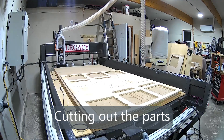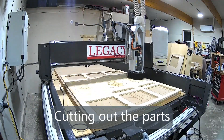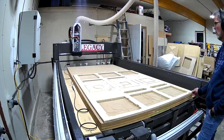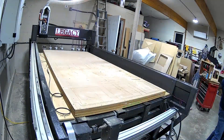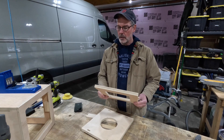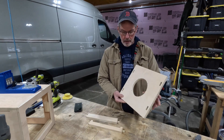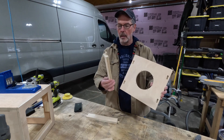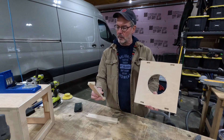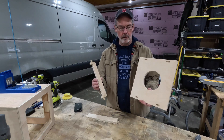With the design complete I went to the CNC machine to cut out the parts and went through a few iterations working through some issues with the joints. On the third try I had a pretty good result. I pulled off the sheet, cut out the tabs, and we were ready to go. Now I've got all the pieces from the CNC job cut out and ready to be assembled. I used mortise and tenon joints to make the assembly a lot easier, and I'll go through and put in pocket holes in all the appropriate places, then assemble the box.